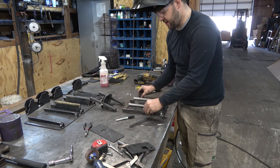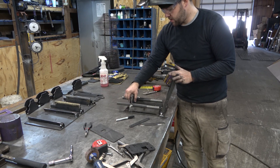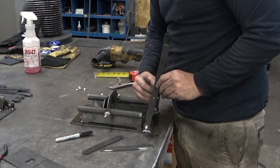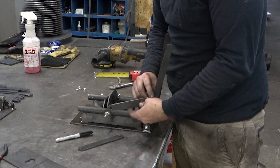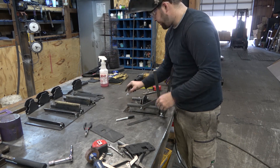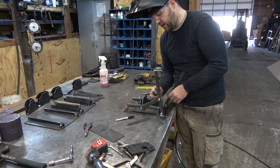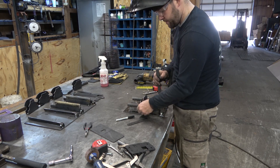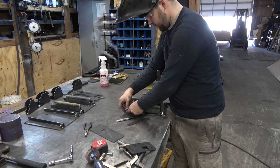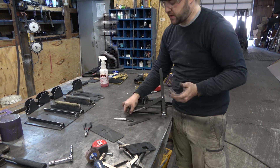Take your two linkages and the last two bolts you have. Open these arms up. Make sure your carriage is in place. The head of the bolt goes on the inside of the body of the crusher. Slides right onto there. The kit's going to have a plastic washer that you put in the middle of this joint. You want every nut on here to be tight, then back it off a quarter to a half a turn.